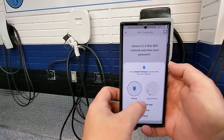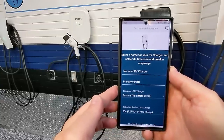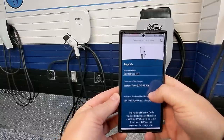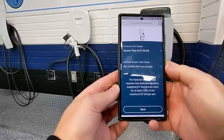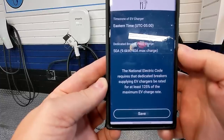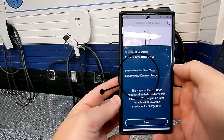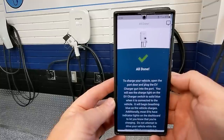The app will ask for your location — you can choose precise or general. You'll then see your Wi-Fi network listed and enter your password. The app connects you to the Emporia cloud, where you can name the charger and enter the type of EV you drive. It defaults to a 50-amp circuit for 40-amp continuous power delivery — that's where you change the output if you want less power or if you hardwired it for full 48 amps. The app reminds you the circuit needs to be rated at 125% of the maximum charging power. A 60-amp circuit is needed to deliver 48 continuous amps. Finally, the app checks for firmware updates and you're ready to charge.